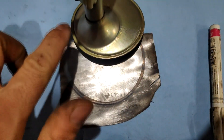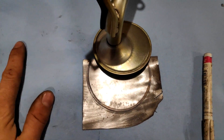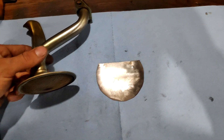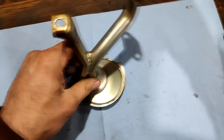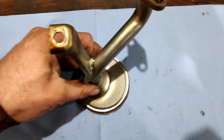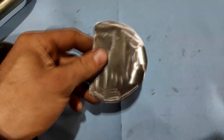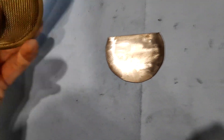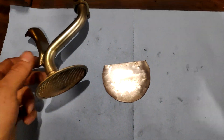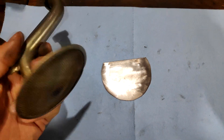After bending, it's still going to follow the contour of the pickup nicely and then we can weld it on. I've traced it out with paint marker right around the edge, leaving a little more than an eighth of an inch wider than the pickup. I got my little three-quarter moon shape cut out here. I'm going to clean my edges up — I'm TIG welding this on, so you want a nice clean process. This is in your oil system, so you don't want any pieces of weld going in there. After you're done, take some brake clean and compressed air and clean it all up really good.